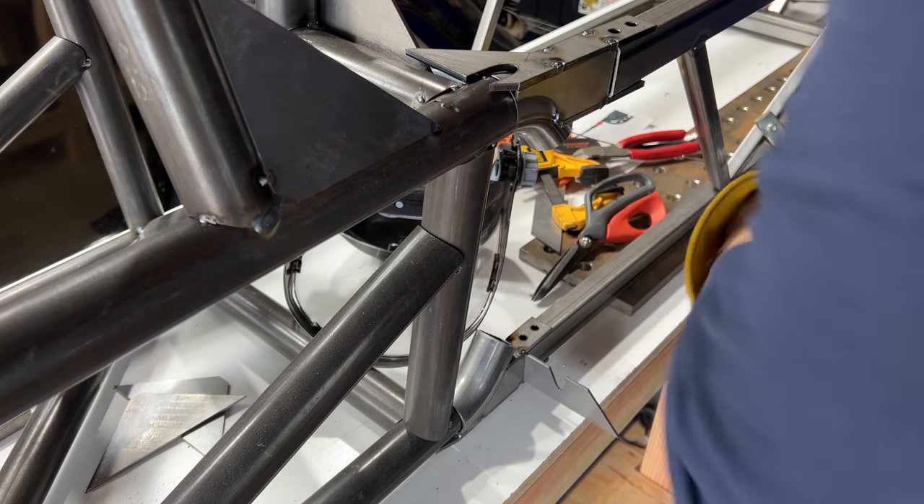First I want to get the front suspension mounts welded in, and then I can use lasers to make sure it's level and square with the frame before tack welding and bolting it in. Some of you are looking at this engine bay and thinking there's a lot of extra space. I did this for a few reasons — mostly because projects like this often run out of space. You always forget about things like fuel tanks, fire suppression systems, heat exchangers, and possible future expansions like turbochargers or second engines. There's not really a drawback to having this extra length here — it helps push the center of pressure back behind the center of mass, making the car more aerodynamically stable. It also gives a longer wheelbase, which makes it more mechanically stable. I might also move to another class in the future, like electric, which will need battery space, or maybe I'll swap in a V8. Lots of room!